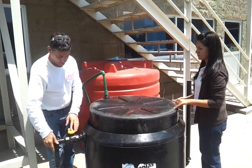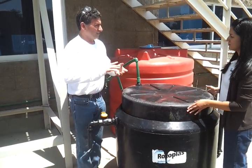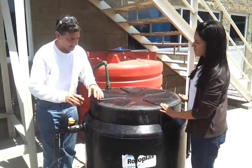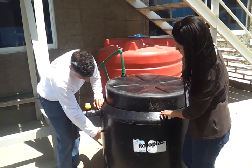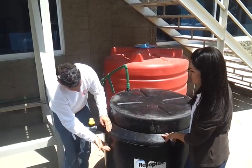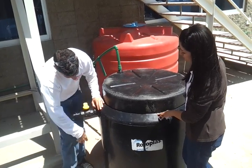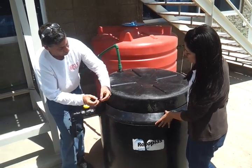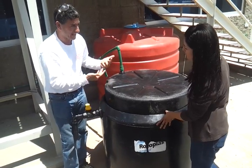The fertilizer that comes out here is a beautiful liquid fertilizer for growing all of your vegetables, fruits, spices, and herbs. The only modification I make is I put the outflow pipe in the center with an elbow, because there's grease in the food waste that floats to the top and we don't want to lose it — the grease is rich with energy. We keep the outflow coming up from below so it spills when high, but the grease stays for the bacteria in those pipes to eat back, producing much more gas.